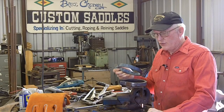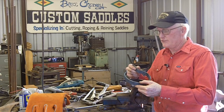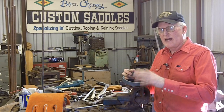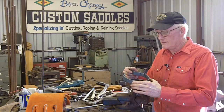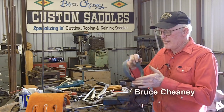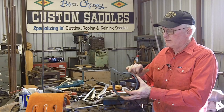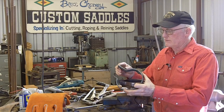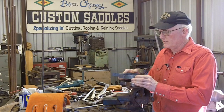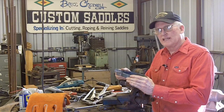This material has a crust on it. This time I did not dress it down to begin with — I feel like that just makes the material too thin. If I belt sand it on both sides, bend it, I'll have to dress it down again later and then it works the metal down too thin. So I'll clean up the outside here. These strips are going to have a couple of initials and a couple of oak leaves on each side. I'll clean the outside up, mount them, then I have a solution I'll dip these in to clean the inside up and give it the look I'm going for.